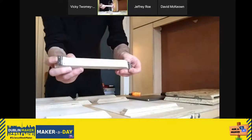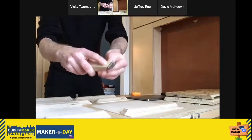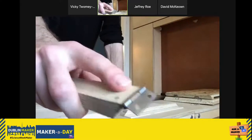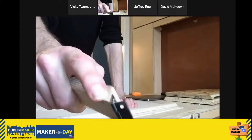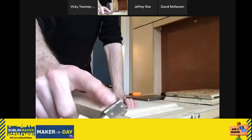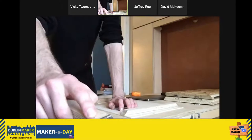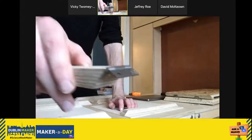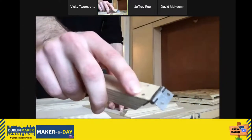And we're going to put the hinges in place first because we want to make sure that if the screws pop out, which they actually did here on this side, we can deal with it. They do that sometimes because the screws are longer than the piece of wood. We obviously got only a small piece of wood there to attach to. But what we can do is get a pliers and cut off the ends and then file it down with even an emery board for nails, or we can use a metal file to get rid of the ends of the screws there. So as you can see, they are quite flush in comparison to when they would have been sticking out right the way through the wood.